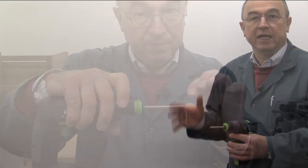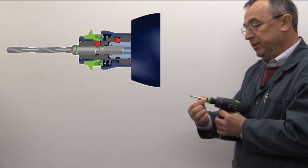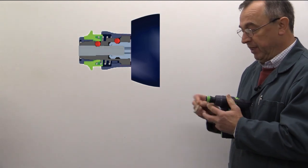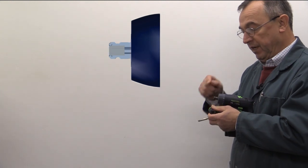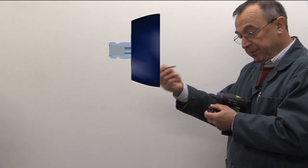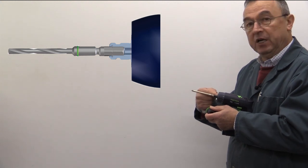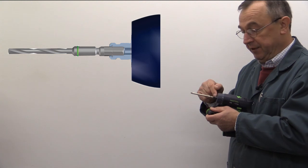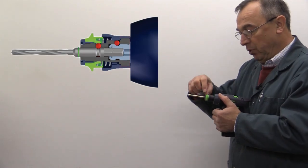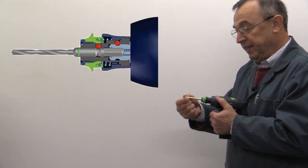When it's a drill bit, stability is particularly important. In this diagram I'm showing a Centratec chuck and a Centratec bit — in my case a posi drive. If I were to remove the Centratec bit from the tool chuck, and then remove the tool chuck from the drill, I'm left with the drive of the drill. When you insert a Centratec bit through the Centratec chuck, it actually goes on into the drive head of the drill, so it's getting its drive and primary support from there. Putting the Centratec chuck back in place, it then gets precision support from the chuck — two support points, held very firmly.